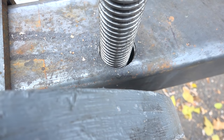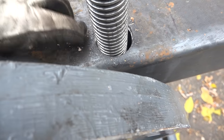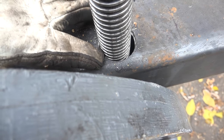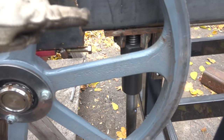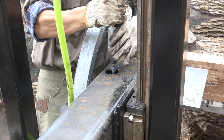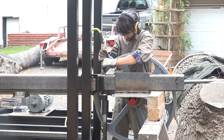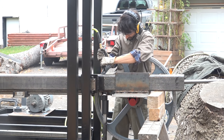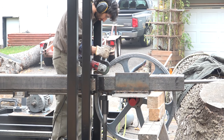I have the same problem on both sides. I should have made the clearance holes on top bigger to account for any misalignment of these two holes. I need to remove material from this side of the hole to give the rod clearance so the nut is in the right position to go into the block. I'll grab my die grinder and remove some of this material to give it more clearance. This is taking way too long, so I'm switching to a cutoff wheel in the grinder.